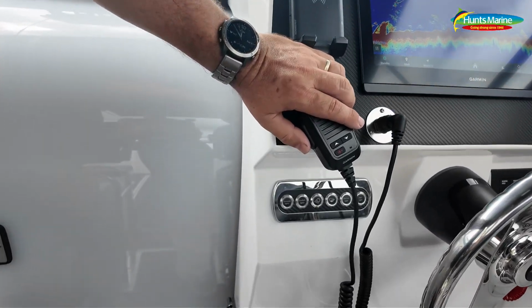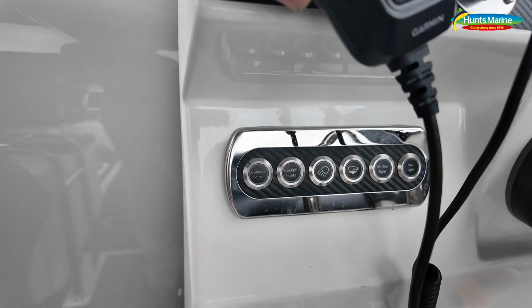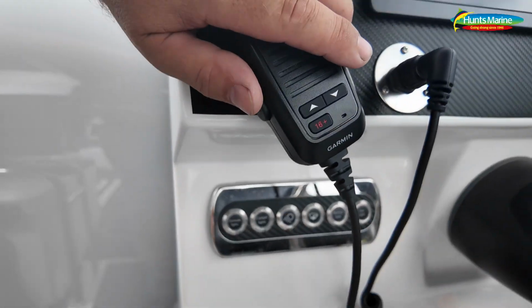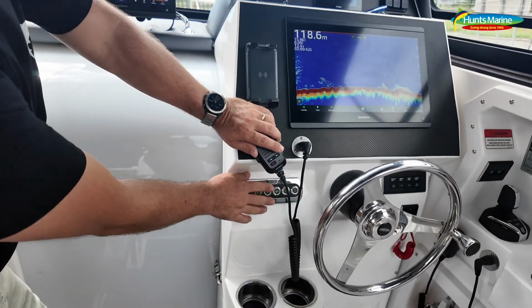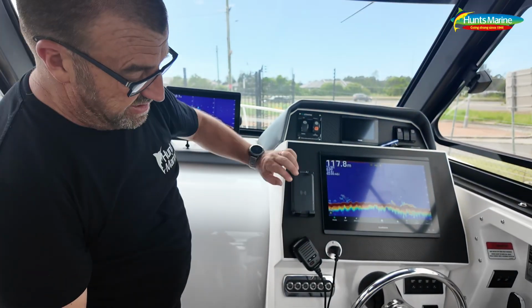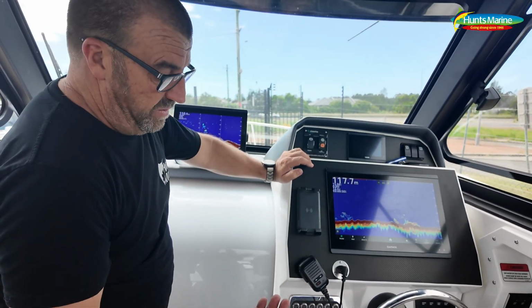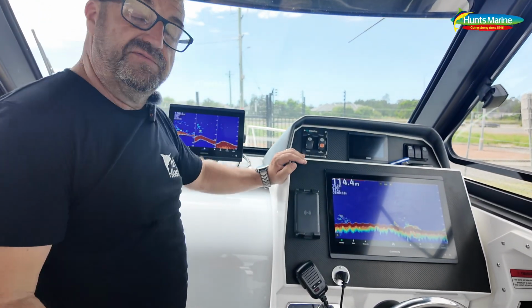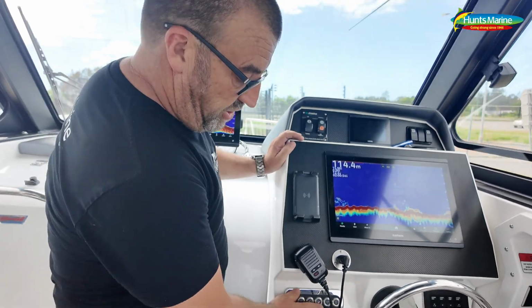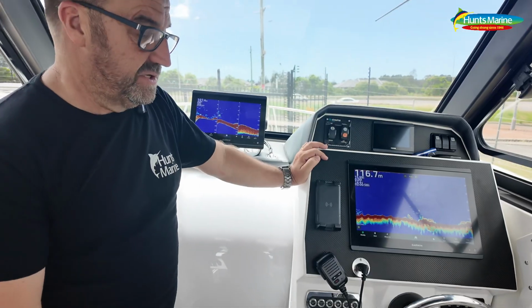And so switch panel just below here, guys. We've opted for, it's got white lights under the gunnels as well as blue strip lighting under the gunnels down both sides. You've got rear lights facing on the hardtop facing backwards, which I showed you when I was up top there. Bilge pump override, so your bilge pumps are automatic. They'll come automatically. If for some reason that function failed, you can turn them on manually. Then you've got your anchor light and your navigation lights.